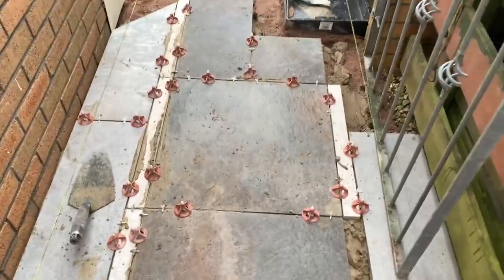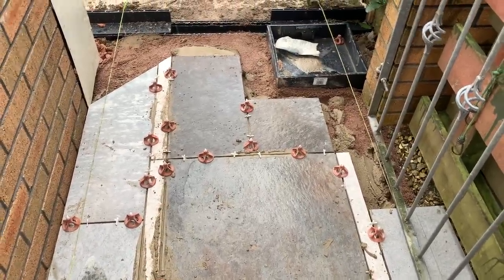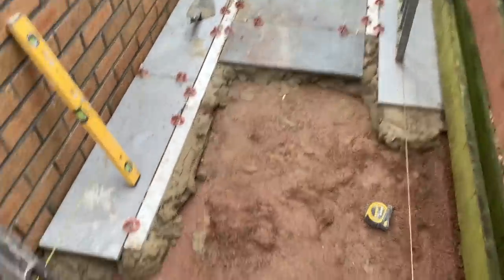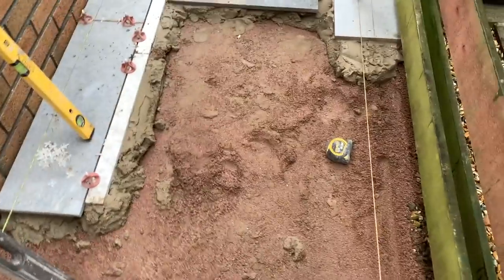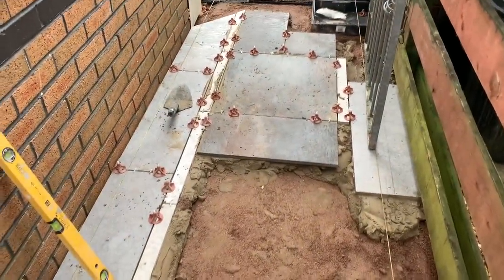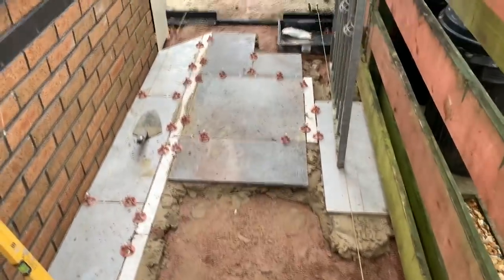As you can see where I started, it's a little bit messy, but it always is a bit messy. I'm not going to bother with that bit yet and this cut yet. I'm just going to run this lot in, but you can kind of see the principle of what's happening. I got my string line there, centimeter full over the top. Gray, ivory, copper, ivory, gray, bish bosh.